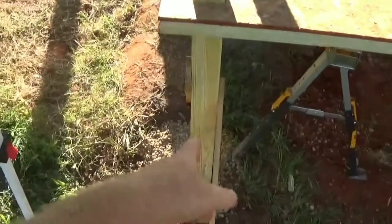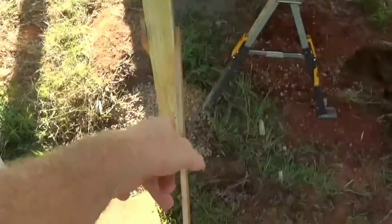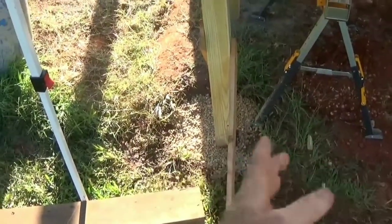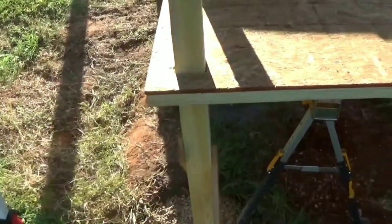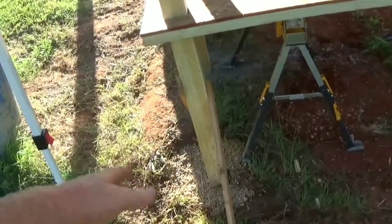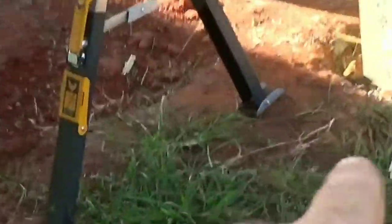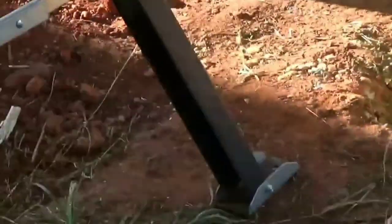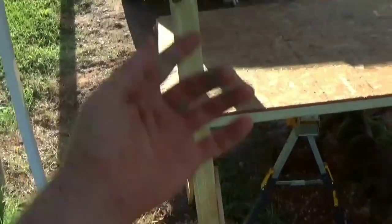Needless to say I had to dig this hole out more too, but I got it all lifted up, got my pole set underneath, got the frame back on top of all four poles, got this one squared up after chiseling and lifting so I could get the pole out to dig that hole more and kick the bottom out to get the whole thing perfectly perpendicular. I got it braced, used half a bag of quick-crete — which ran out — then finished with professional grade. It's a little lower but not bad; I'll put some gravel on top.